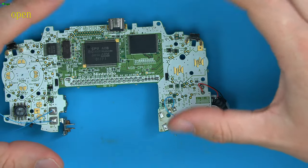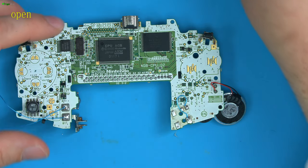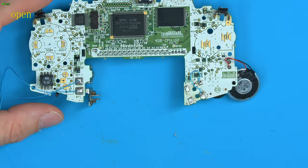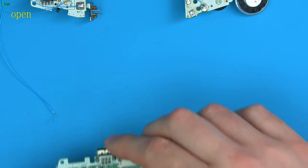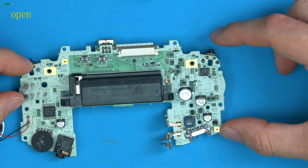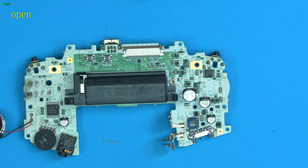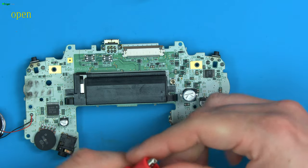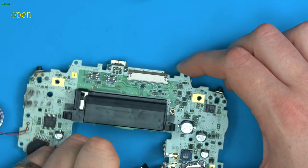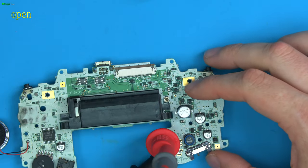So next steps to figuring out non-working triggers here. We need to now see something on the multimeter at a minimum. So I want to see what a working board does first. So let's bring back a working board. And I'm presuming this will be 3 volts or 5 volts, and when we press to ground, it will sink. So let's just prove that theory. And we can also test the other board afterwards and the CPU pins to make sure it's happening right.